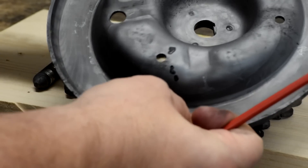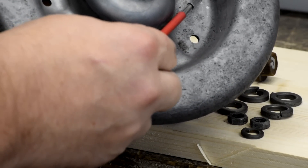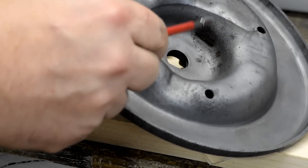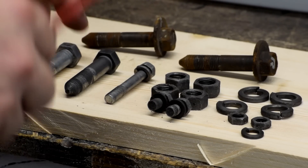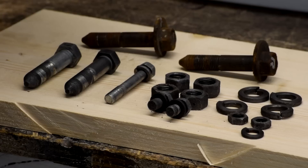There are a couple of spots where a thicker piece was encrusted and it didn't touch that. So it seems like it's really good with a light surface coating — bolts it works on well. A natural application would be rusty parallels for the mill, which are a pain to clean off. Soaking in this seems like the perfect application for thicker more encrusted stuff. Bead blasting or mechanical means of removal is probably better for heavier rust, or perhaps in conjunction with the Evaporust, like I've done with these.